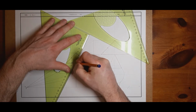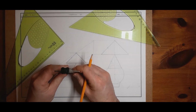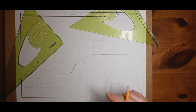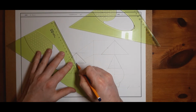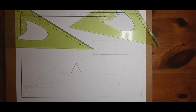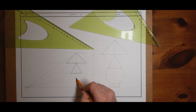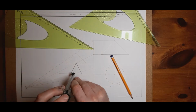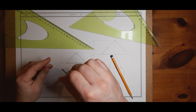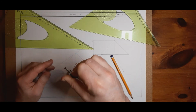Slide it over a bit. So he is parallel to this guy here. And then if we want the other side, you can slide it parallel as well, or because it's symmetrical, we can just mark it off there. And now we have the base. We also have here the radius. So the radius is going to reduce as well. Now I do know the center of the circle will be here. So we can set our compass to here, and we can go now and draw in the base or the circle there, the partial circle, bringing it up to the base.